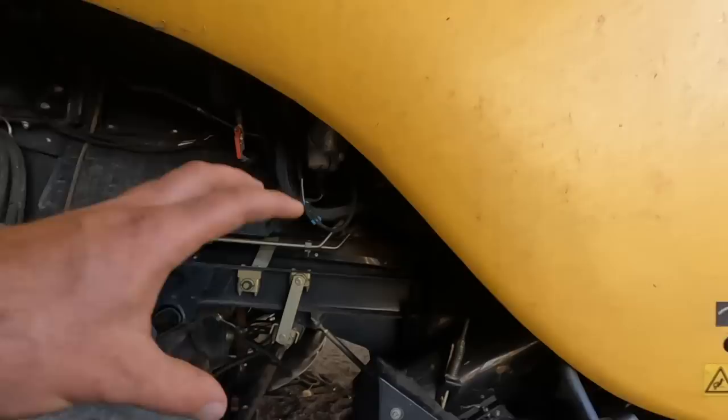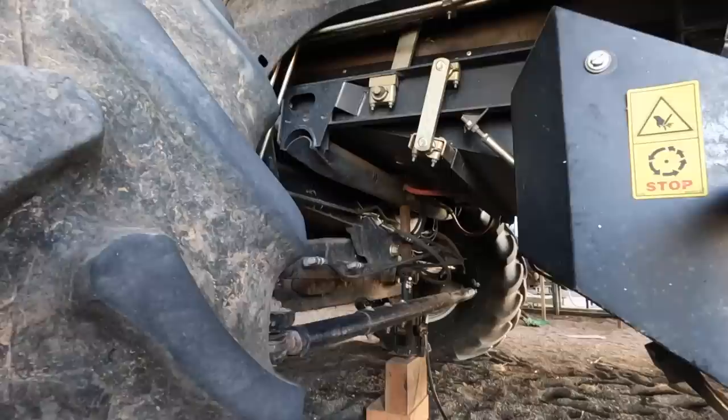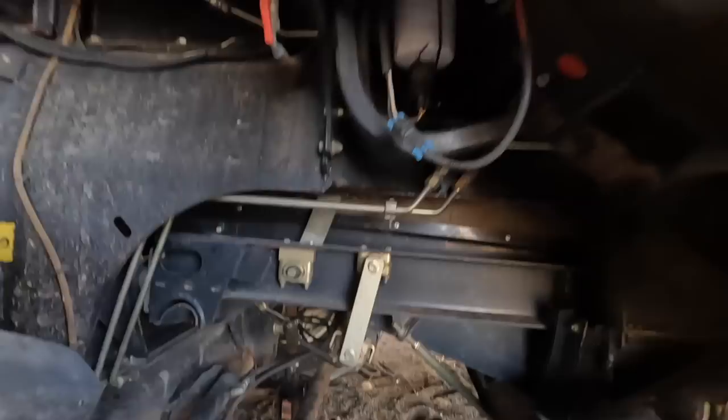Just with that shuttering that was still happening with this one in the whole shaker shoe assembly, we've decided we'll just replace the rear bearing as well. It was a little bit tight and a little bit of movement, but we're just going right through it to triple check, make sure everything's okay, just to try and eliminate or reduce that shuttering a bit, because it's obviously causing a few fatigue cracks on different things, so we just want to double check and make sure that's as good as we can get it.